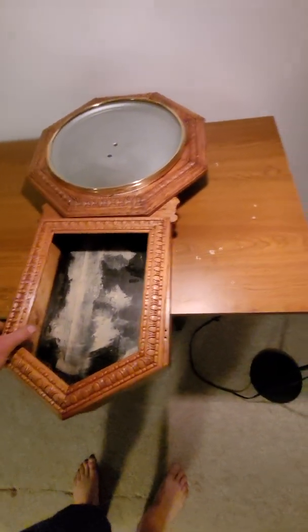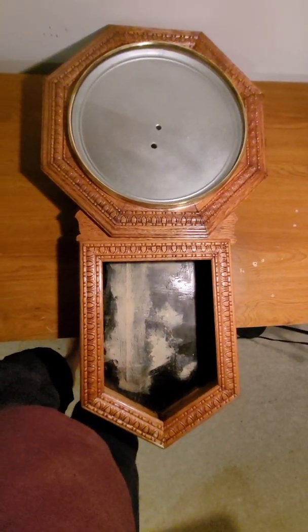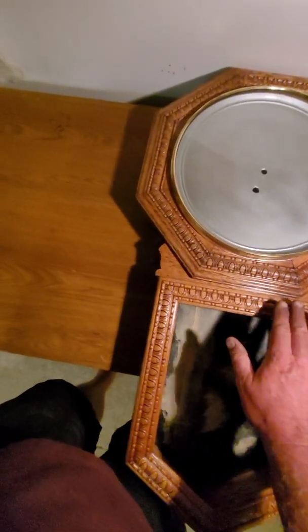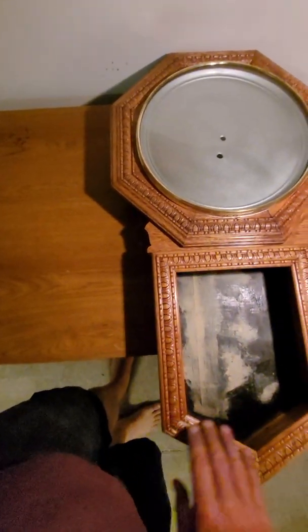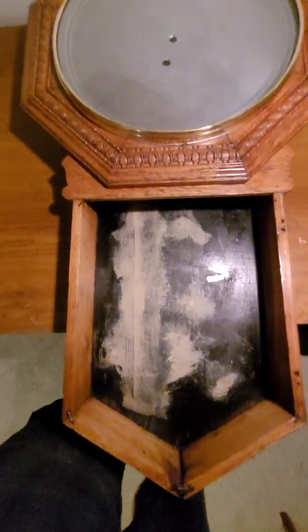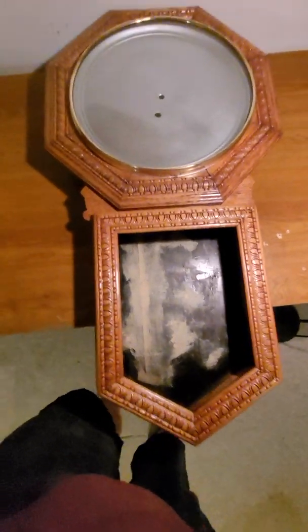It's pretty nice. Now, the next step, here it is, there's the door. It turned out really nice. It looks a little shiny because the finish is so new. Remember when we knocked that down with a little 4-aught, it's going to tone down, of course. I like to let it harden for a week or so before I do that, because then the finish is very hard and cured, and you won't smear it. So the backboard has all been filled and sanded. I'm going to paint the backboard semi-gloss black, again to display the nice pendulum on this clock, and seal it, of course.